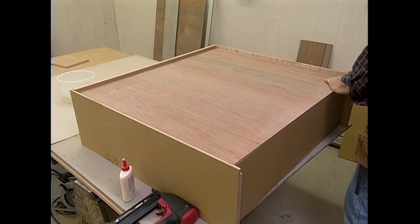Tomorrow we'll make doors for these cabinets, some drawers, and the countertop. Good morning. I thought I'd drag out our new benchtop drill press because I'm going to need that a little bit later. Last night I hung the doors on the wall cabinets, assembled the other base unit, and worked on a detail that's really important. Anytime you have a kitchen cabinet, bathroom vanity, or a cabinet in the workshop, in order to work comfortably at it you need a toe space. So what I did is extended the top by 3 inches — this also gives me a bigger work surface.